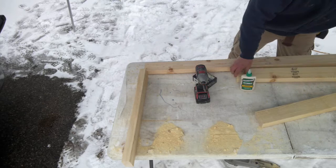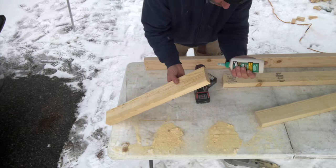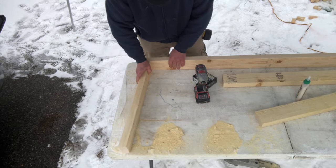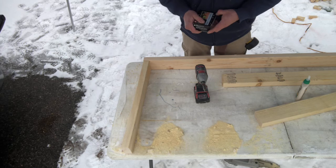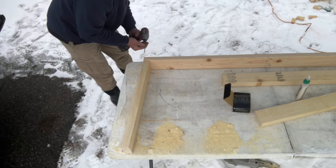Put it on its side and just screw it together. I'm gonna put a little bit of glue right here on this edge. This is exterior glue, which is water-resistant, and that means for our sauna project it's gonna be a little bit more durable for those extra temperatures. Screws are three-and-a-half inch exterior, and let's screw.